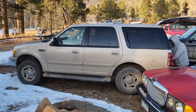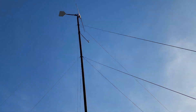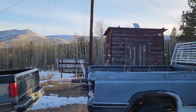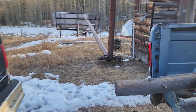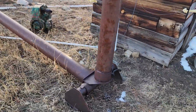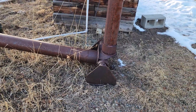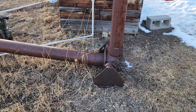All the anchors are the same way, and it tips down this way — the wind turbine would land up there. The tower is made out of three sections of 12-gauge 6-inch tubing, and the tower tilts down on this. There's only one pivot on this tower base. It's better to have two pivots — one for the gin pole, one for the tower — but I used to do it this way.